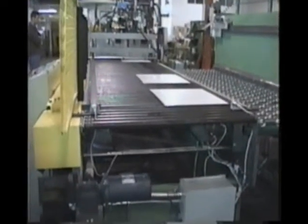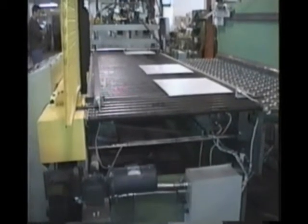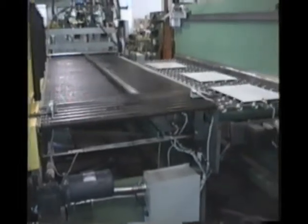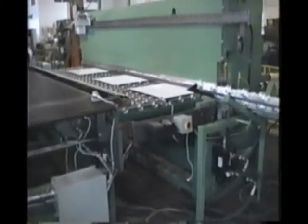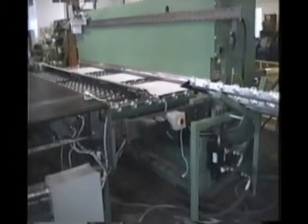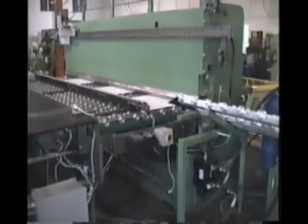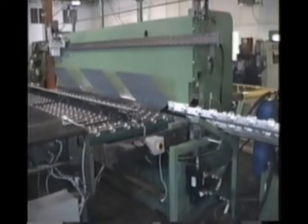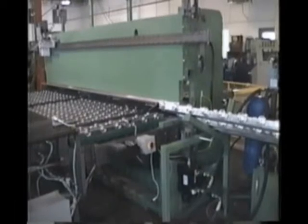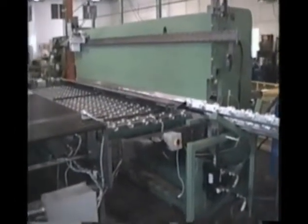This system was designed and manufactured to produce a wide variety of electrical wireway enclosures in lengths ranging from 1 foot to 10 feet in 1-foot increments. The overall system is a complete coil feed application to notch and punch a variety of electrical knockout patterns down the length of the parts and edge punch the outer flanges for a wide variety of hinge and screw cover applications.